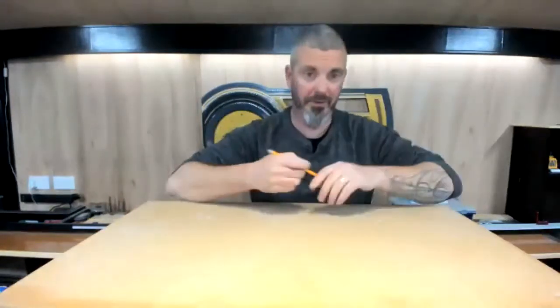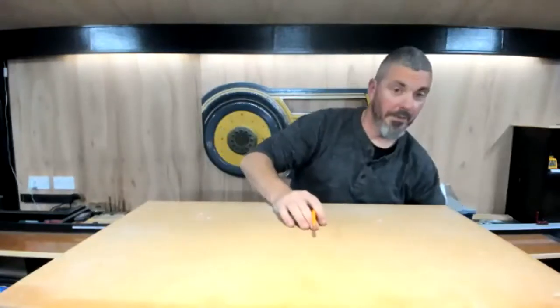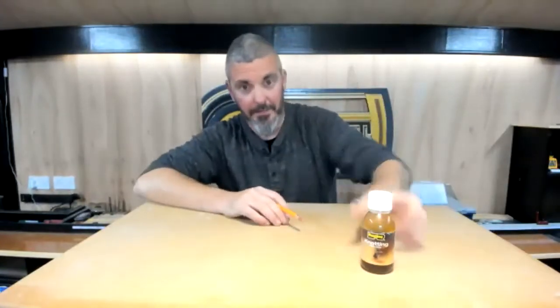So people will go around to the knots in their skirting boards and put a dab of undercoat, and then they come along and undercoat the whole skirting board the next day or whatever, and then every knot has had 2 coats of undercoat. I've seen that fail, so I don't do that anymore. If I have knots, I use knotting.